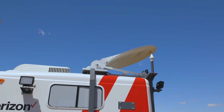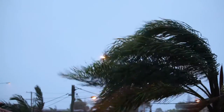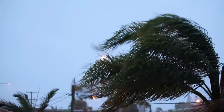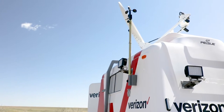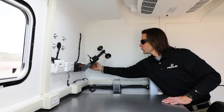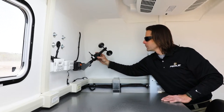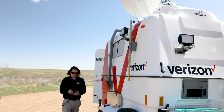The satellite antenna can only maintain stability and signal strength below a certain wind speed — in this case, winds exceeding 45 miles per hour. Extremely high winds can also damage the satellite antenna. For these reasons, the satellite backhaul system is equipped with a wind speed measurement device. The anemometer head of the wind speed sensing unit must be removed from the storage bracket mounted on the interior wall of the MCT, behind the workspace, and installed on the top of the exterior stanchion located on the curbside of the trailer.